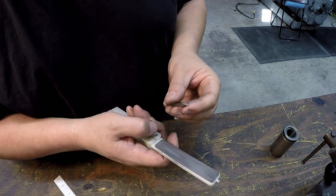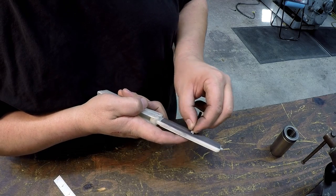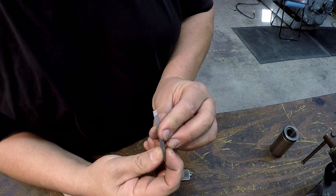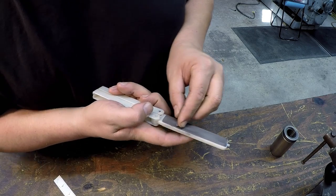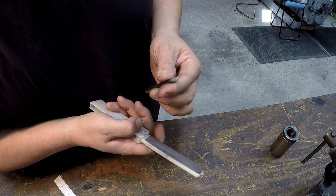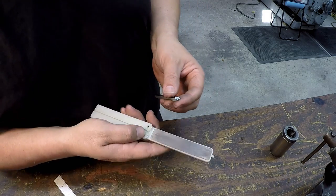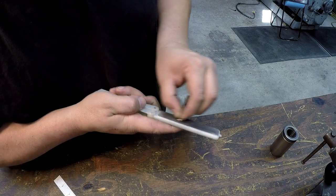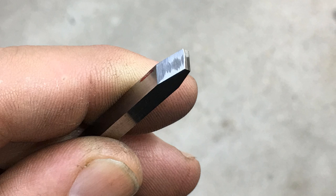I'm happy with the geometry of the grind. Now I'm honing it — I want a nice honed cutting edge on the tool bit. I'm going with the coarse side first on this hone and it's cutting in nice, then I go over to the real fine side. It puts almost like a rainbow mirror finish on that tool bit.